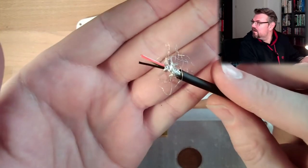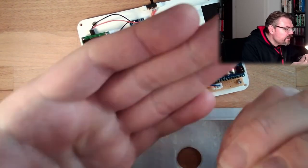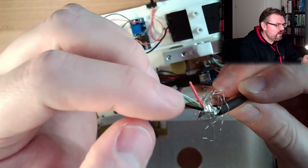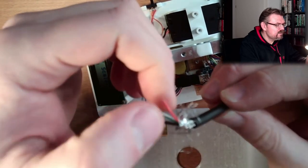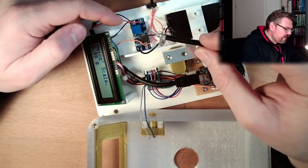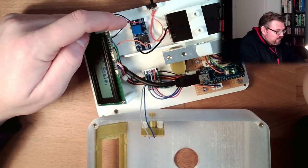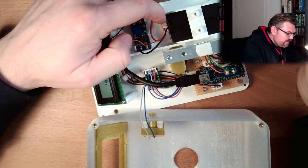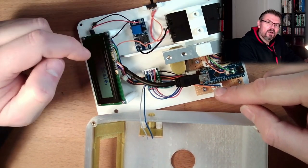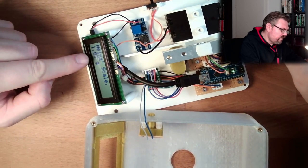And you can see, or maybe you cannot, but I can tell you, the red and the black ones, they are bigger because they are for power supply. And those two, they are the data lines. But I don't need the data lines. So I just use the black and the red one for power supply. Then I've put another minus line here, because I put also a second line to here. I want to use an analog input to measure the voltage of the... ooh, look, 1.54 grams.